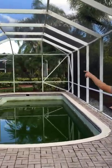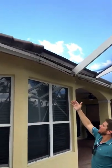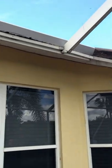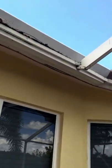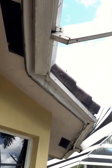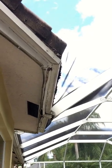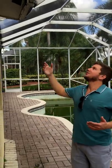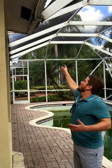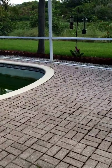Our last issue here is a waterproofing one — it looks like the screen builder couldn't figure out how to properly install this gutter. You can see we have a little 4-inch structural gutter, and then at this bay window, no gutter whatsoever. This is indicative of somebody not being able to figure out how to get a downspout out of the enclosure. The right way is to gutter this section as well, put a downspout down here, and bury a PVC pipe that drains out into the yard.